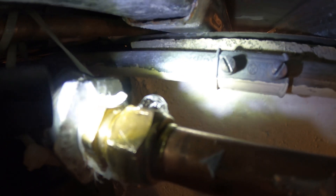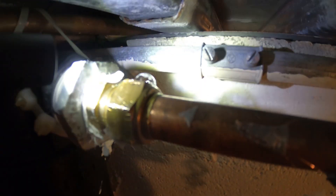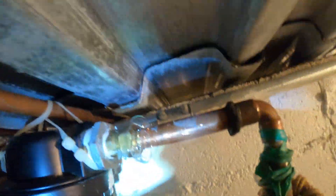I cut back the tape and put a little soap and bubbles — you can see the bubbles. So we're leaking from right here at this flare. Putting some soap and bubbles right there — you can see that connection is leaking. Let's go fix that up.